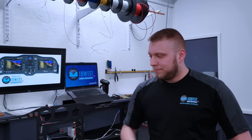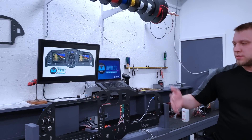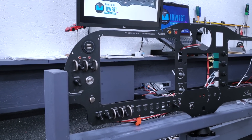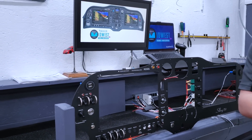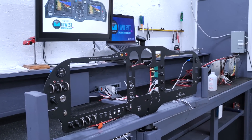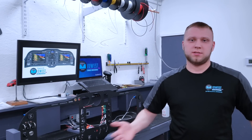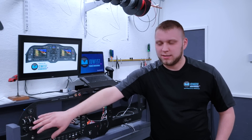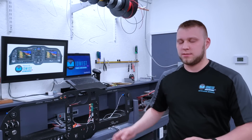With this system, your master is always on the switch. So if the IntelliKey system were to ever fail, your master is not shutting off. Furthermore, unlike a car where the push-button is tied to the ignition, if the system does fail, your engine just doesn't stop running. It's all tied to the lane switches for the engine, so as long as those are on and the engine is already running, a failure of that system won't cause catastrophic issues.